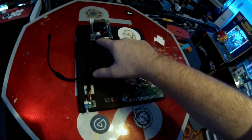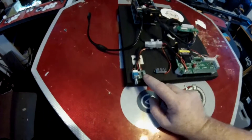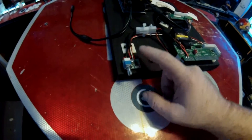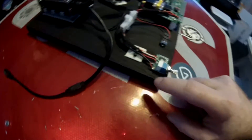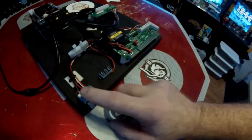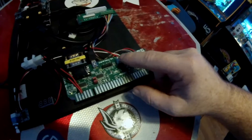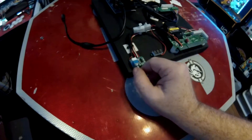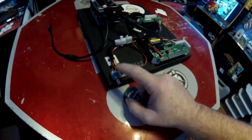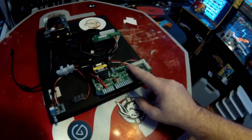For audio, I have it coming out of the 3.5 millimeter jack here, and then going into this tiny little 3 watt amp. The input comes here, and I get the 5 volt from the JAMMA edge to power the amp, and then it outputs to the input line of the JPAC. So we do have amplified audio, which I know is not a good idea, but this is so low powered that it doesn't really make a difference. The output of this to the input of the JPAC gives us our audio on the board.